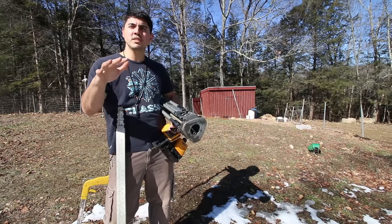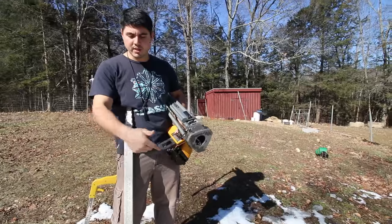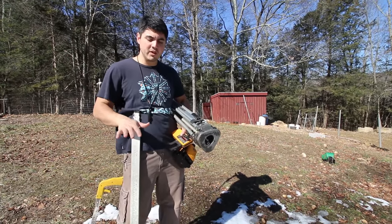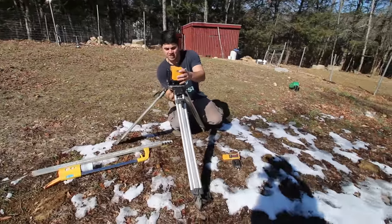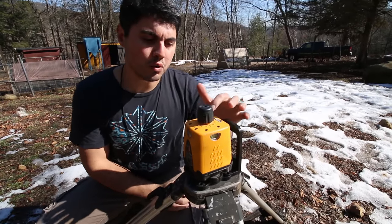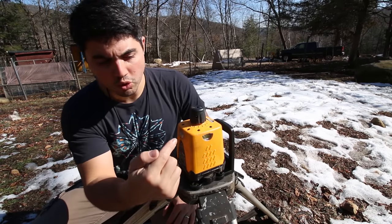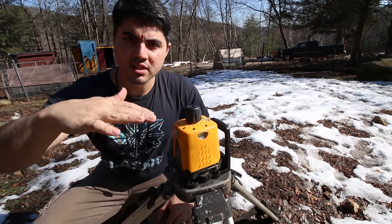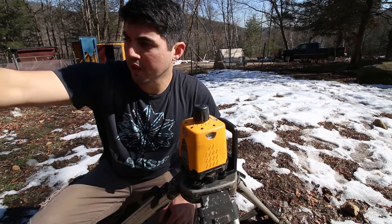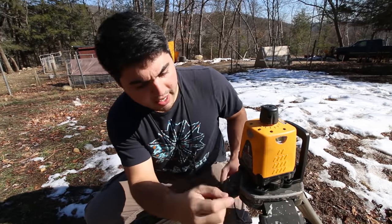So I'm going to set it up in the middle of my workspace, and you want to set it up higher. If you set it up too low and the laser runs into the dirt with elevation, you won't be able to use it. So I'm going to set it up on the hill here in the middle of where I'm working. The way this laser unit works is it spins, sending out a laser beam, and you make sure by leveling it on both axes that it's shooting out a beam that is perfectly level. That way you can take your receiver and check the grade on your property. The first thing I have to do is level this.